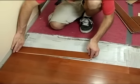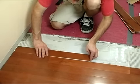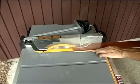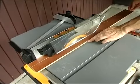If you use the cut-off pieces from the end of one run as the start of the next run, you can avoid wasting the flooring. The very last row may also have to be trimmed with a saw to fit, depending on the width of the room. And there you have it, a nice, shiny, new engineered wood floor.